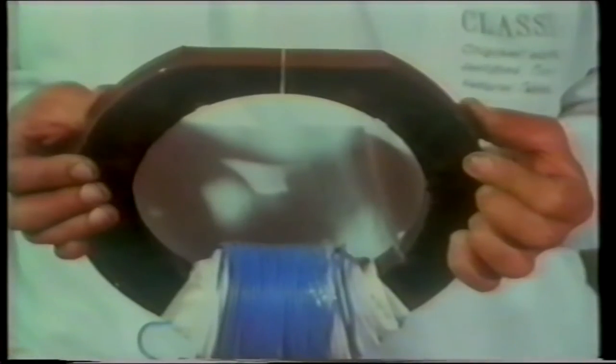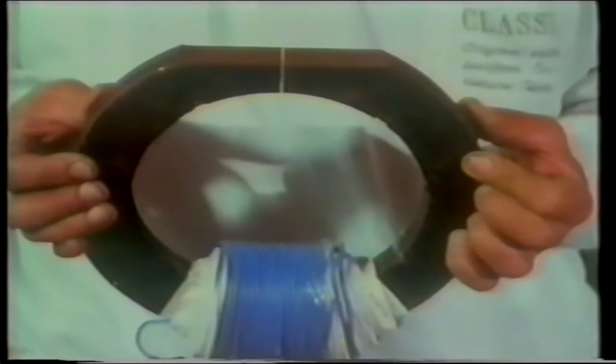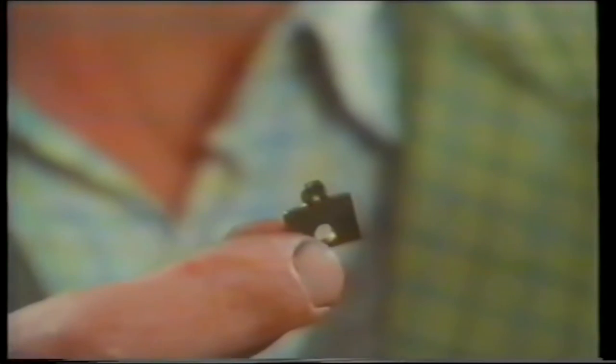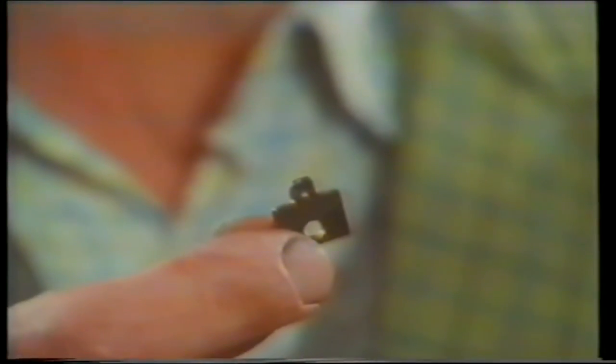The ring-shaped recording head with a gap that's been used ever since was also perfected by the magnetophone company. When you push a model of the tape past the gap, you can see how it's magnetized. The smaller the gap, the smaller the magnets created on the tape, and the more information that can be recorded on it. That's why video heads are so small. The gap on the heads of a domestic video machine has to be exactly three thousandths of a millimetre across. They're the most accurately made thing in the home.